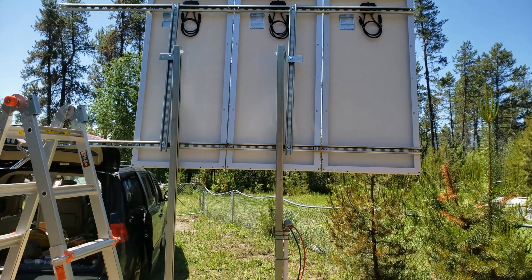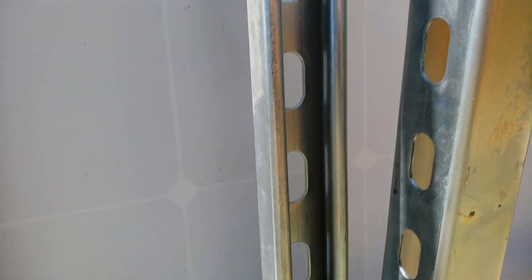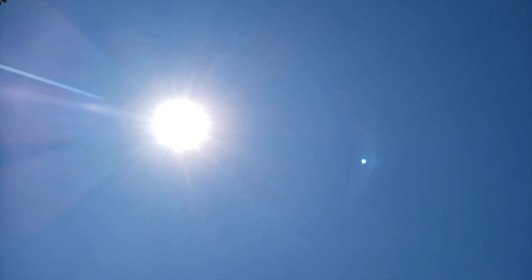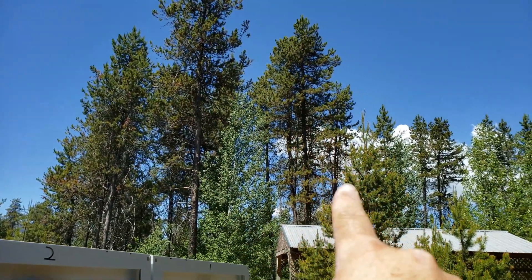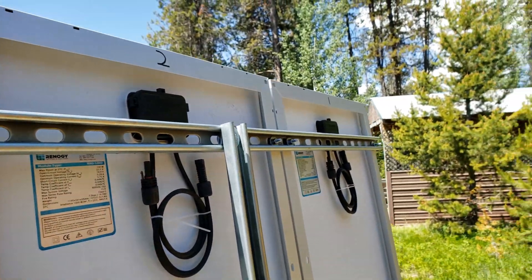I'm going to try and brace it across the back in a few places to see if I can clamp it down and keep it from twisting. I just used typical unistrut bracketing — I used these L-brackets and I wanted it to be adjustable for winter, spring, summer, and fall. The sun is straight up above us and it tracks all the way up here and then sets right behind these trees, so the panels are going to be almost facing straight up just because of how far north we are in the summer. I've got one bolt on the inside of the panel spaced with a rubber washer, then just a washer, bolt, nut.